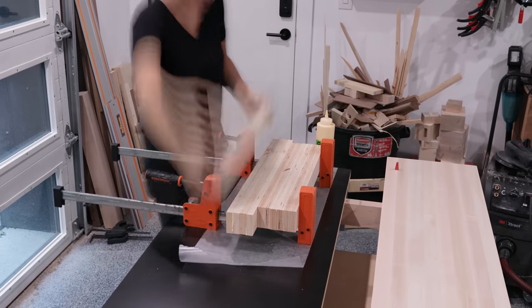The wider glued-up supports are going to be in line with the dog holes I'll drill on the hardwood portion of the bench, so before placing them inside the torsion box I need to know exactly where those dog holes will be. I'm selling a dog hole template on my website to help with the layout and cutting of dog holes, so this part should be really simple. The template is made of acrylic with center lines etched on the underside so you can easily see where to place your holes.